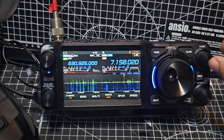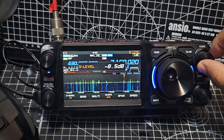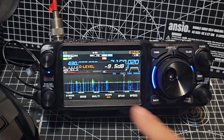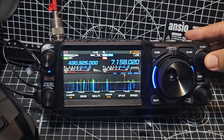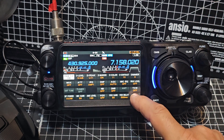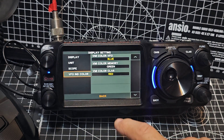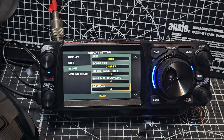Back to the 3DS. The idea of setting the D-level here, which is turned by your function knob, is that you can control the waterfall spectrum a little bit. I have turned on averaging, which is available on this model now. Let's go function, forward, display, and go to scope, and then look — averaging. I've got it on number four; it goes up to eight.